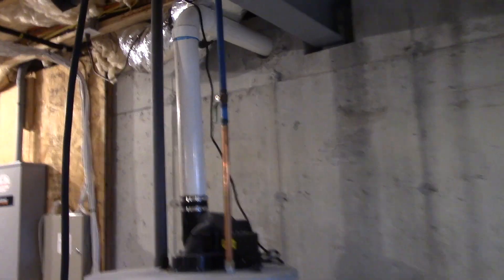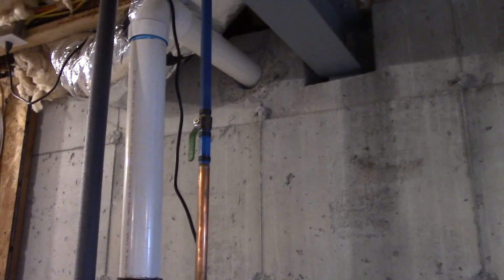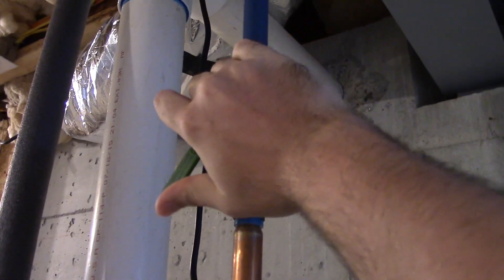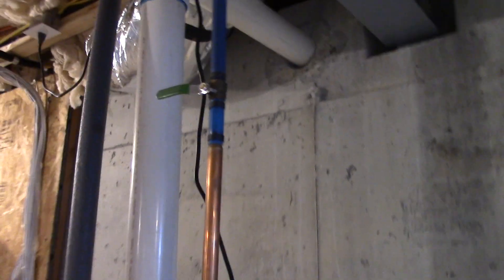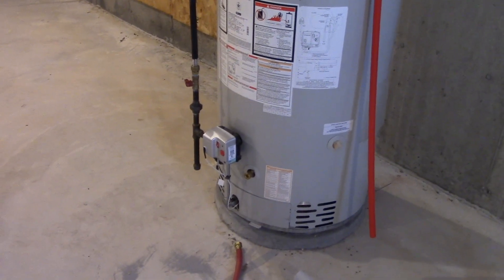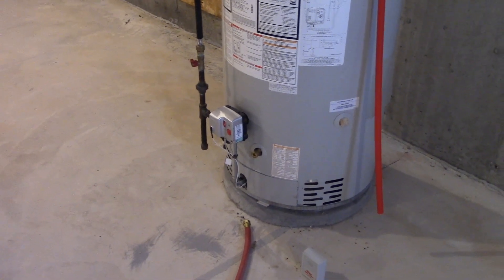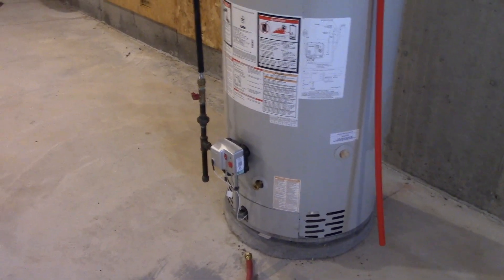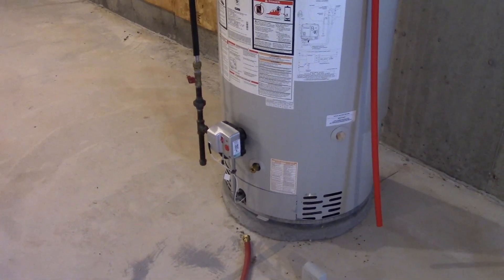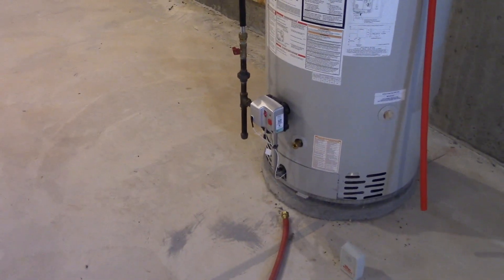Up on top of the water heater here, you'll see there's the cold supply pipe which supplies the water to the water heater. So the first thing is you want to go ahead and turn that off. I have a simple ball valve right here. So we've gone ahead and turned off the water supply. But one thing you want to do is also go ahead and open up a hot water faucet, just for the sake of taking pressure off the system, but also if you try to drain without any of those open, it's like trying to get water to go through a straw with your finger on the top of it. So opening a hot water faucet will allow air to enter the system and allow the water to drain more freely.